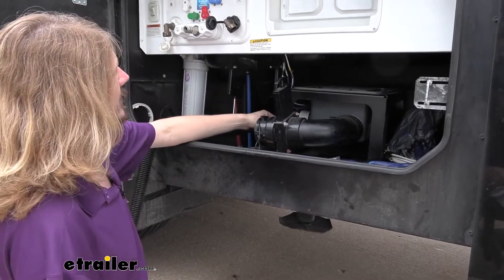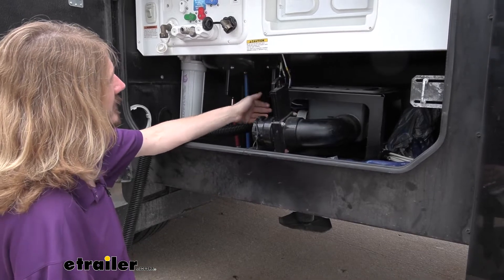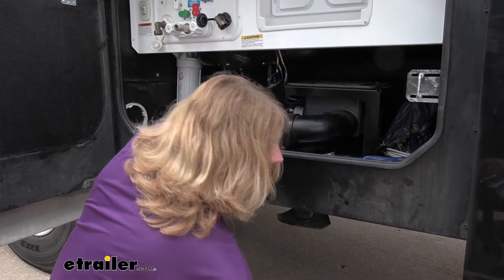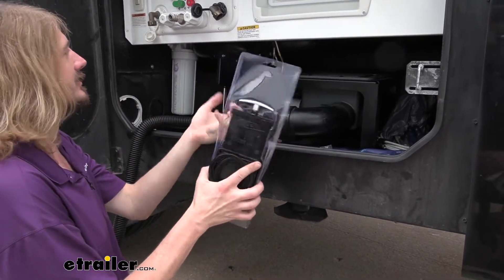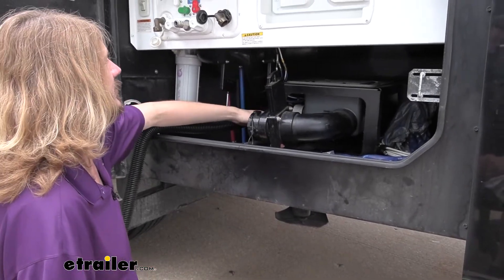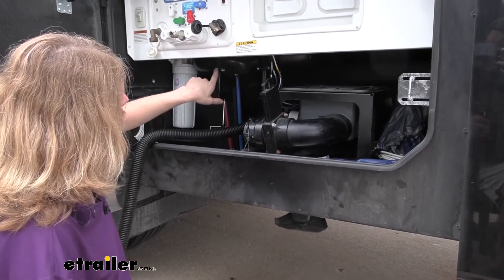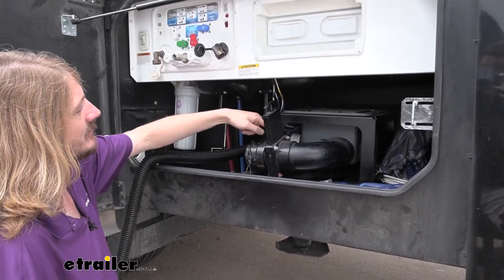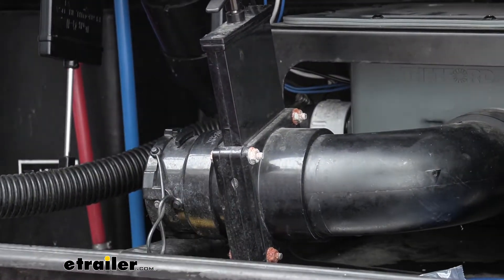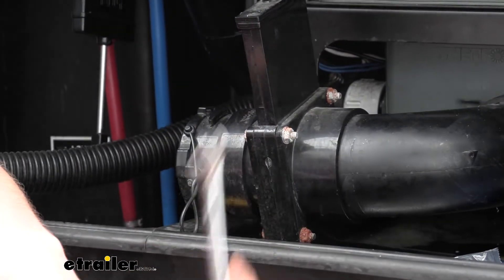This valve here is a little bit loose — you can see it — due to the close angle it's in. So we're going to be replacing it with an upgraded metal handle version, which is a little bit heavier duty. To get these out, we're going to remove the four fasteners that hold it in place — two on top and two at the bottom. We'll use a 7/16-inch socket and wrench, or 11 millimeter, which is also very close — you can get away with either of those.